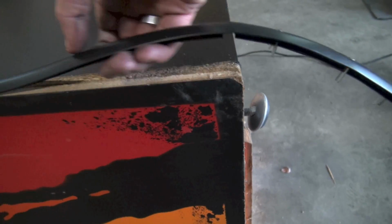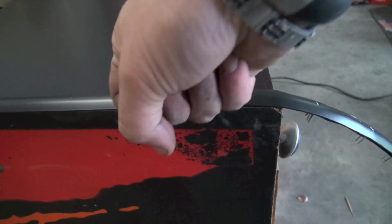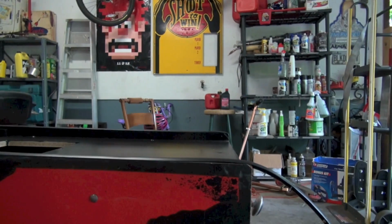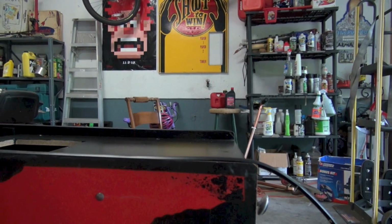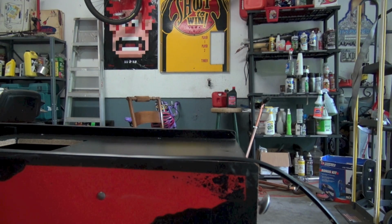We're going to put some tape on the barb here and then pound it in, and the tape and the pressure of the barb along the sides will just keep it in place. So I'm going to do that. So why don't we get some tape. Just from pulling the T-molding out and stuff, it stretched out the gap, so this little trick will take care of it.